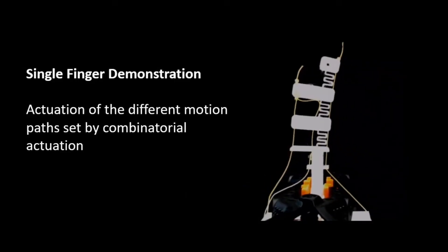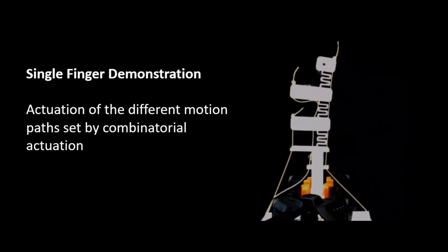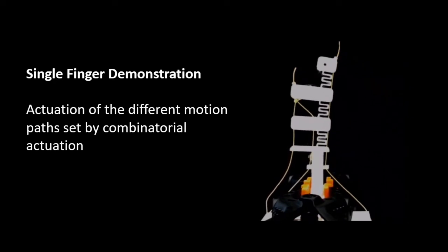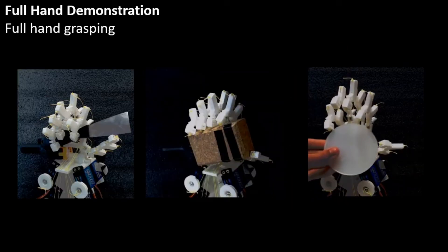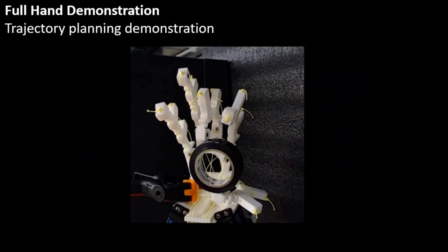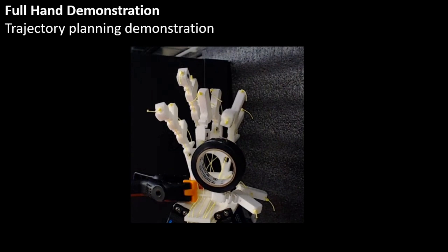While designing Fingy, I discovered another project using flexures at Carnegie Mellon's Create Lab. Their hand uses S-flexures for knuckle joints and seems to use a different plastic than PLA. In my experience, when I print S-flexures in PLA, they tend to break quickly after extensive use, and when they are stretched, they get deformed — which is why I'm using spiral springs for knuckles instead.